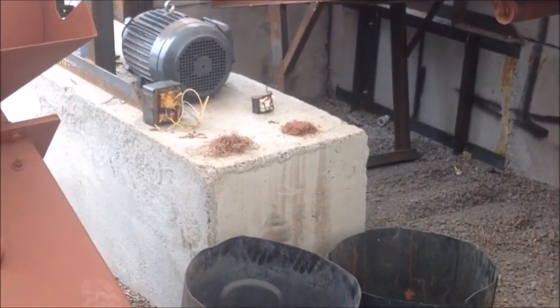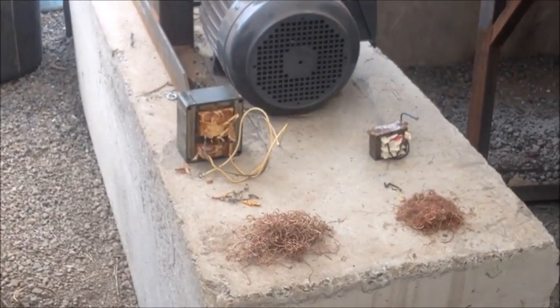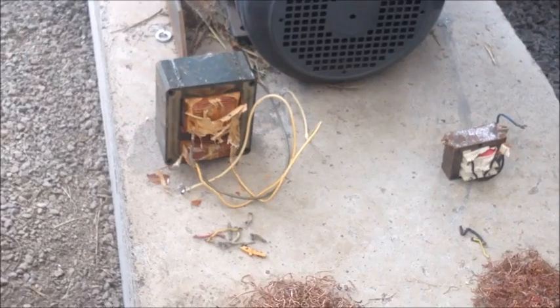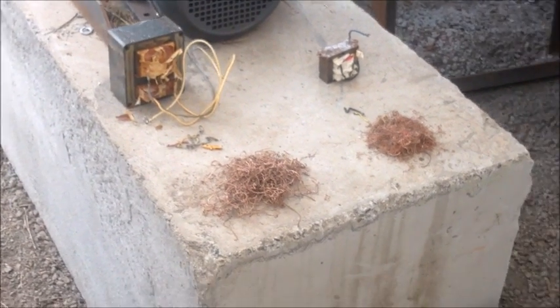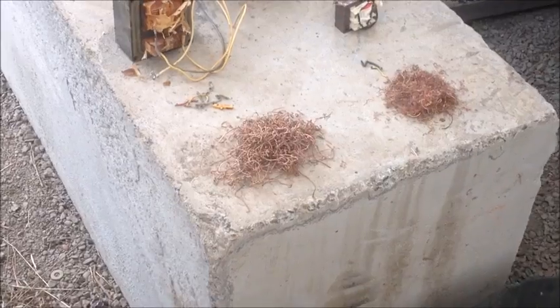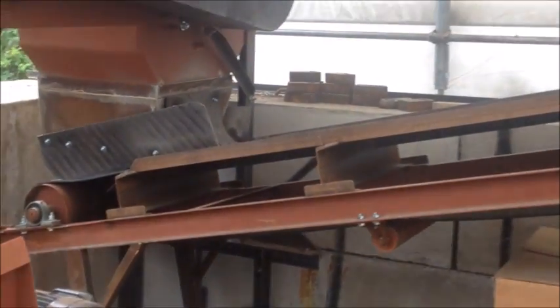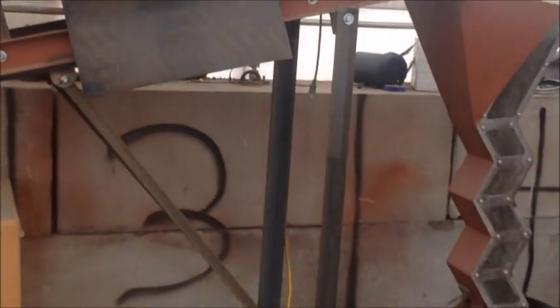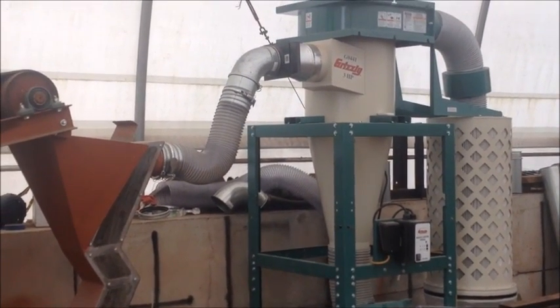There's a limit to what this size hammer mill can take. This is a 24 inch by 16 inch hammer mill, and these 14 or 15 pound transformers may be just a little bit too big for running production. If you're going to be running day in day out, you might want to reduce that to maybe an 8 or 10 pound maximum transformer. We do have a larger hammer mill in the works. How big of transformers do you need to process? Is 15 pounds big enough? Do you need to do 25 pound transformers? I appreciate your feedback and I appreciate you guys watching the videos. We have fun making the equipment and look forward to hearing from you on the next video. Thanks for watching.